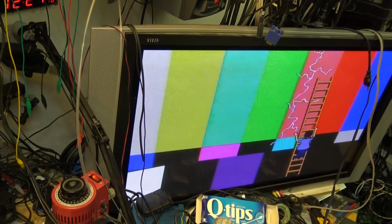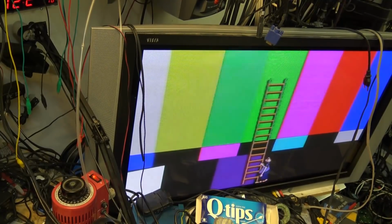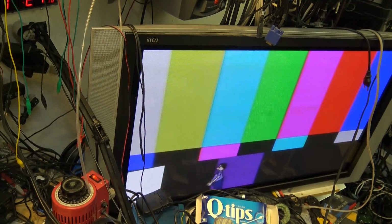This was always something that would go wrong in the studio. Something wasn't right. You lost your gen lock, and you'd end up with colors strobing. Well, not like that, but somewhere you'd have all the colors, all the vectors spinning. If you lost your gen lock, all your color would be going through all the phases.